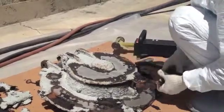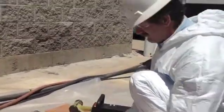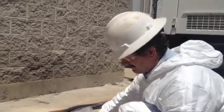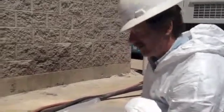So where there was some steel underneath it, I was able to get the induction to work. About a half an inch of steel right there, so that worked. But in general, aluminum is not a good candidate for induction stripping — it has to be a ferrous material.